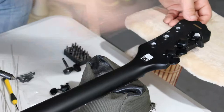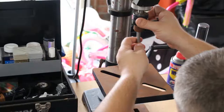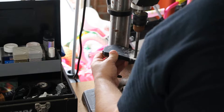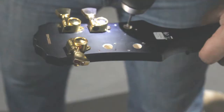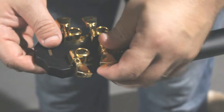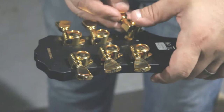There will be some modifications needed for the tuners. I'm saving some parts like screws, but the old tuners are junk — getting rid of those. There are several ways to widen the holes for the new Grover tuners: you can use a metal file and sand the hole larger, but that takes a long time. I prefer using a drill press with a slightly larger drill bit, widening the hole a step at a time, or a variable drill bit. Afterward, use a small grinding bit similar to a Dremel to clean out jagged edges and splinters until you have nice smooth surfaces, then install the Grover tuners.